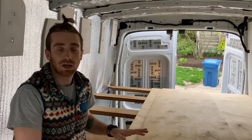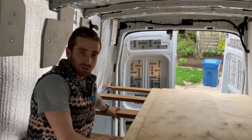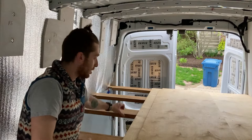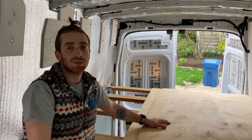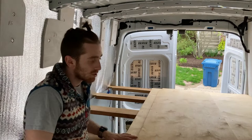On top of that are four main slats. These slats are also three-quarter-inch thick, four inches wide. I also did inch-and-a-half-tall edging strips on each end of these slats to give a little bit more flexural rigidity to the boards. I think if I'd gotten a little bit thicker it would have added even more stability, but I felt comfortable with this being able to take the load, especially since the plywood is going to distribute the load across all the beams and the mattress will help distribute it evenly as well. It's a foam mattress, and all that weight distribution together — I felt pretty comfortable.